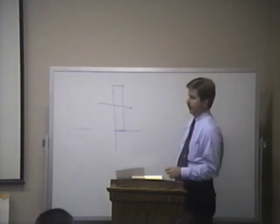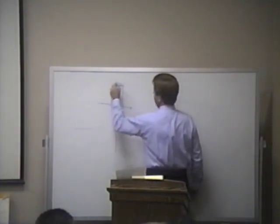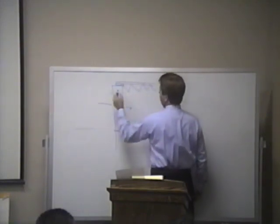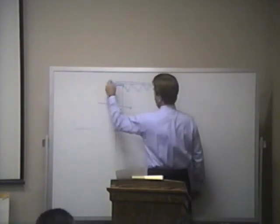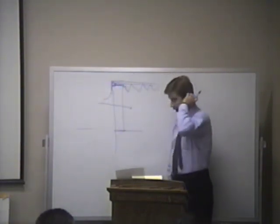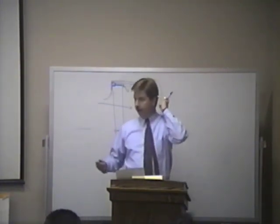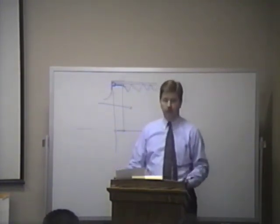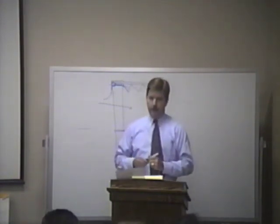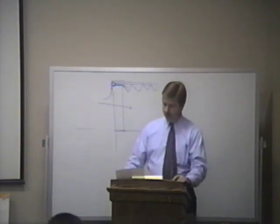In the building, from your block up here, you'll have something to set, and there'll be a joist if you use steel frame, which is most common. Well, then you have elements here, and then you'll have a parapet. The wind comes up in here and whips and can migrate through. There's all different types of ways that air impacts and infiltrates. So what I call infiltration, infiltrates, just think of it as a subversive communist plot. It's infiltrating the building. It has ways to get in there, finds ways. And it's called infiltration.